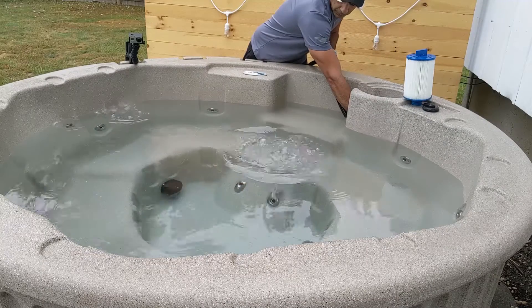One of the great things about these plug-and-play hot tubs is you just put them in the backyard, plug them in, fill with water, and you're on your way. There are pros to that, but also cons to not converting to 220. Some say it costs more to run at 110 because you're drawing half the voltage and more current. But the electric company charges you for kilowatt hours — not by current and not by voltage.